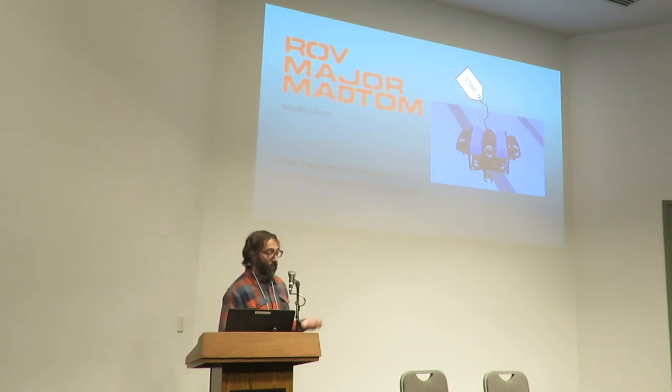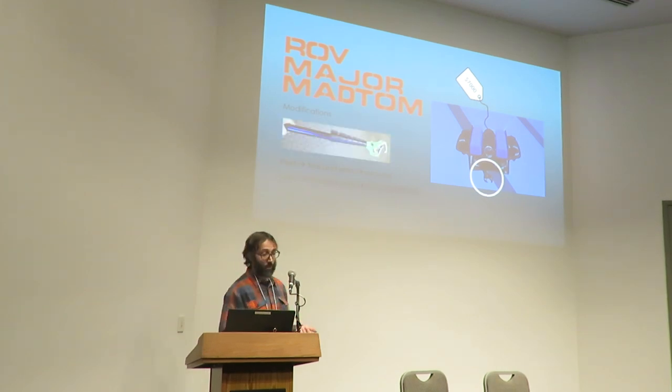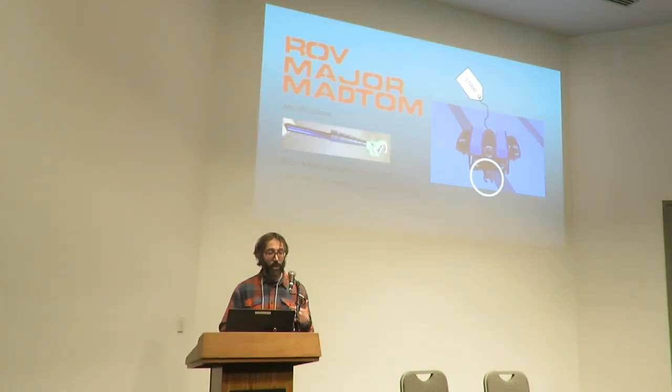This picture was taken at the YMCA on our first test drive. We have an approximately $7,000 price tag on it, so it's very affordable, especially when you think about how much money you're saving in the long run. Highlighted in that circle, the ROV comes with a little claw for picking things up. We hoped to use it to attach clips to our lost receivers to recover them, but we found out pretty quickly it doesn't hold the clip very well. So we made a simple modification — we built what's called a quick clip with a carabiner attached to the ROV, with a rope attached to the boat, so we can go down and attach to our receivers.